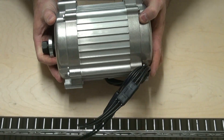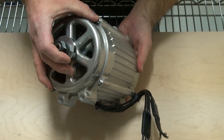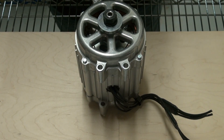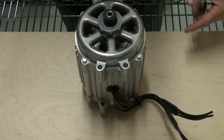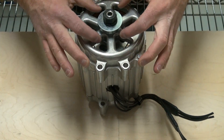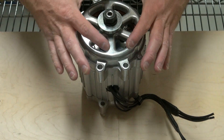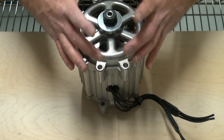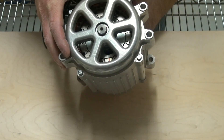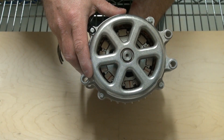I'll tell you what I've seen just right off the bat. The PMG has a whole new front compared to a PMA — it's got large openings on the front so the wind will travel through a lot easier. You can see right down into this thing. The front is polished and rounded, it doesn't look like a PMA, and it's got multiple bolt holes on the front. If I flip this thing over, it's the same way on the back — you can easily see right down in there and see the magnets.